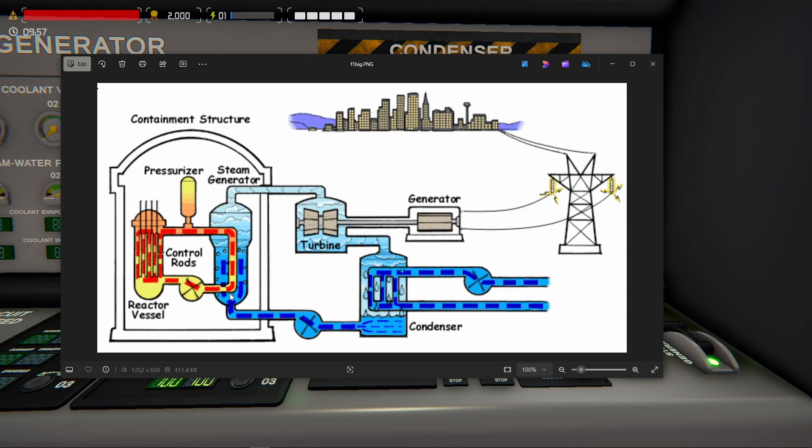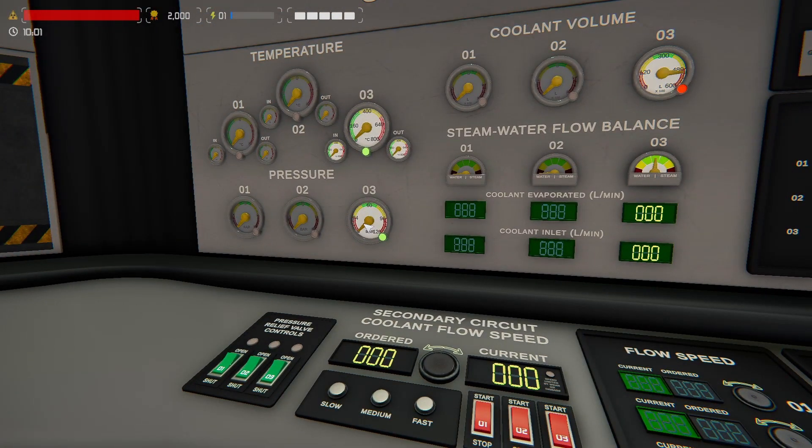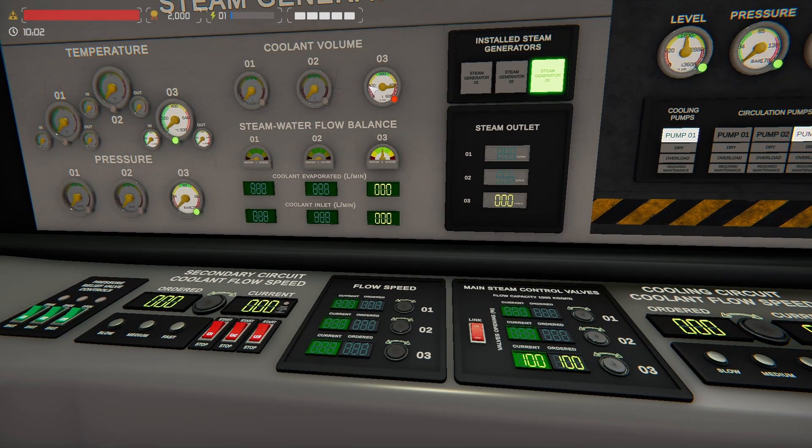Sometimes people will say: I shut off my pump and I keep getting buildup — my level keeps rising. How is it that my level's rising if the water's not being pumped from there to there? Well, because there's still steam in the system. As that steam cools, it goes back to water naturally on its own. All the steam that's in the steam generator — the water vapor in the pipes, in the turbine — it's turning to water and flowing back in. That's essentially why the level will keep rising, especially if you still have pressure. You can also overload that pump by putting too much water inside the steam generator — if there's pressure, you can only put so much water in, so keep that in mind.